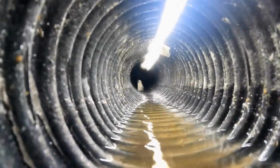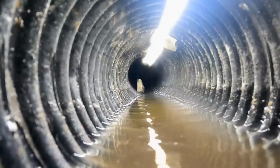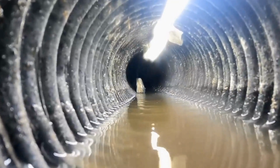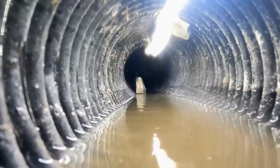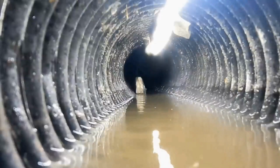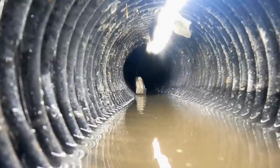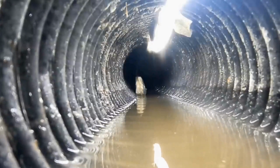During a rainfall event, water rises in your trench and it comes through at the bottom of the pipe. That's why there's a base of gravel underneath. As the groundwater rises, it comes through the voids of the gravel, floods up into the pipe, and the pipe carries this away. This is called a French drain. This is corrugated pipe, and it's slotted. That means that there's holes cut all the way around the pipe.